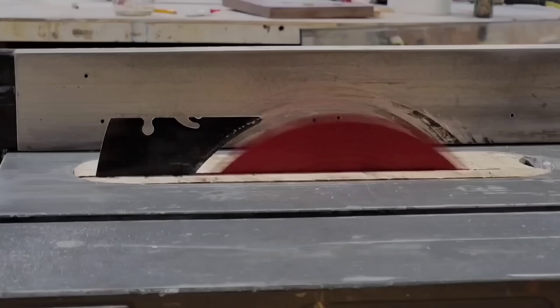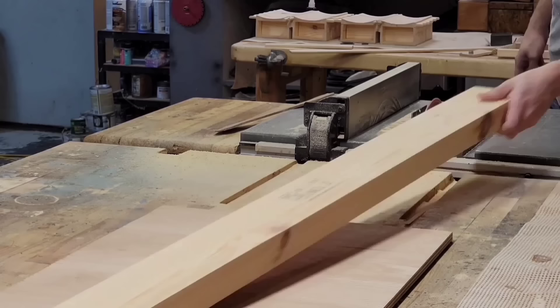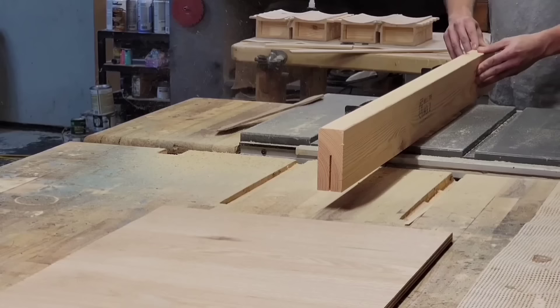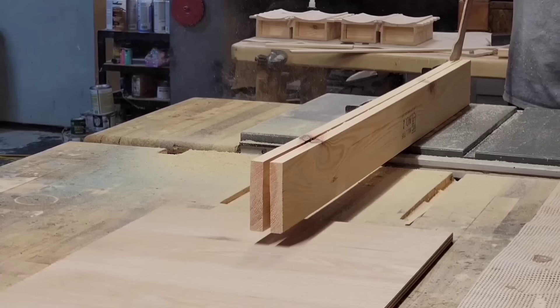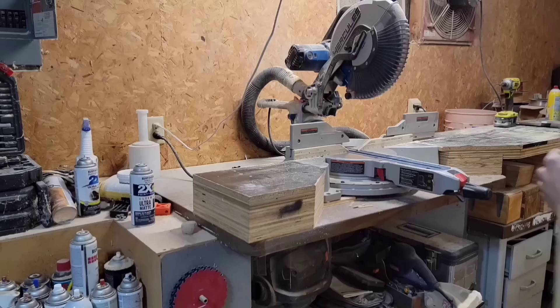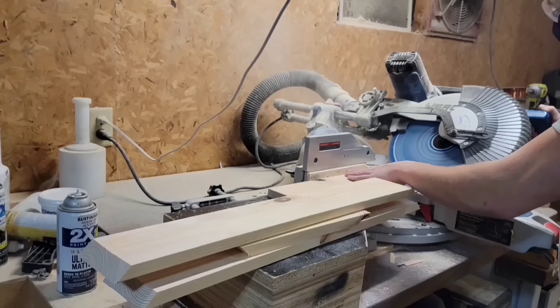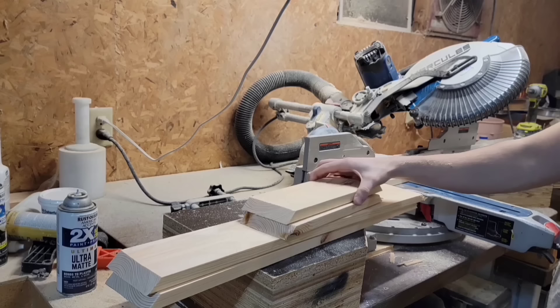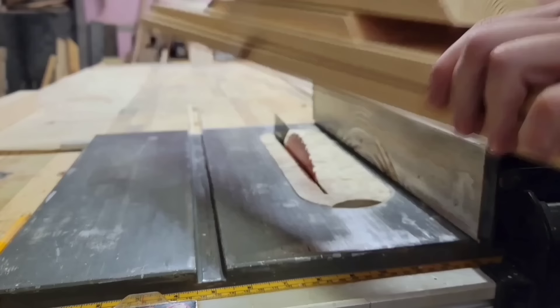Now I need to make a cabinet to hold all these drawers. I still have about 42 inches left of the 2x6, so I ripped that down to about 3-1/2 inches and then resawed that section in half. The cabinet needs to be 25-1/2 by 11-1/2 inches, which means I can miter out one long side and one short side from each of those re-sawn boards. I'm going to use one of the drawers to set the distance between the front of the cabinet and the back panel, then cut a groove in each cabinet piece to hold the back panel.